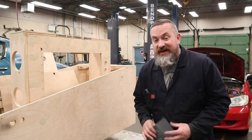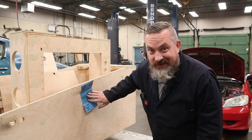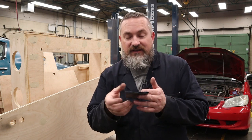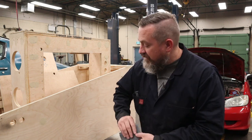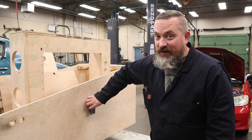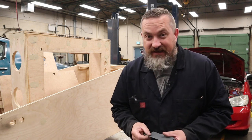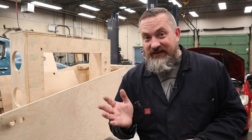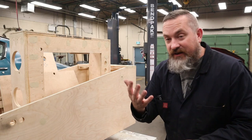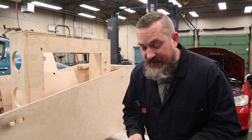All right, now as for the actual sanding itself, do not expect to just put the sandpaper on the surface and start to get it to sand, because it just doesn't work. You're going to have to at least fold it into thirds so that the rough texture of the sandpaper grips itself, and that way you can actually sand. Now, this kind of hand sanding I do not recommend, because you are going to hate sanding. Your fingers are going to hate you for it. But the other thing is, your fingers and palms are not actually flat. If you look at the pads of your fingers, they're kind of curved. Ooh, I am curvy. So what you're trying to do is sand those curves into your surface, and that's not really what you want. So I don't recommend sanding like that.